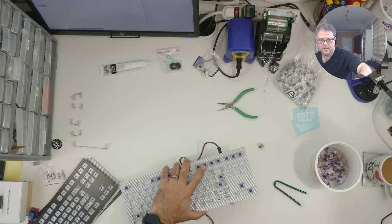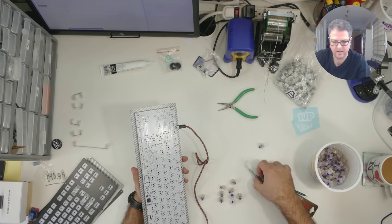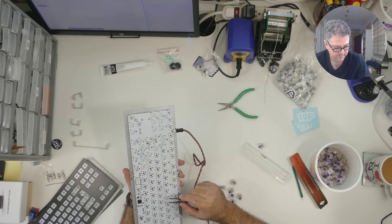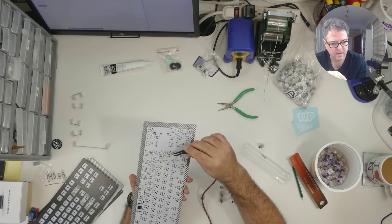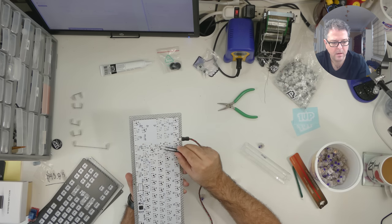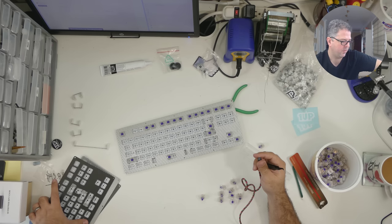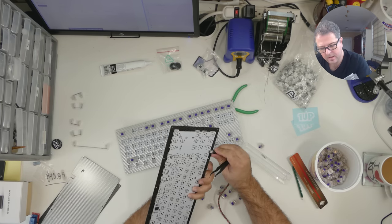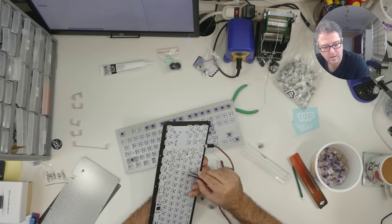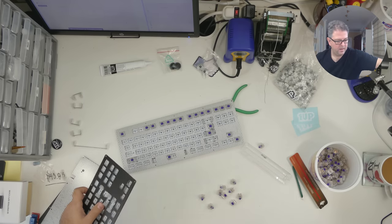Let's just go in here. So you guys will see these disappear, assuming that it tests okay. Where's the enter key, just so you can see it happen? There you go. Okay, so that one worked. You should always test your keyboard before you start building or soldering. And if one switch works, you can make the whole thing come to life. Yep, so they both work. Great. Whew.